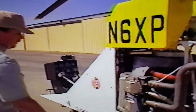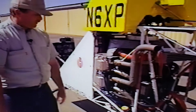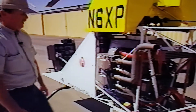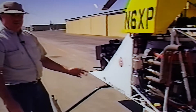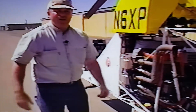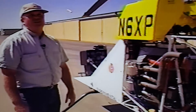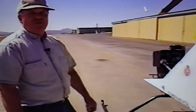As far as the landing gear goes on this helicopter, it's set up much like a Robinson helicopter. It uses a set of tubing that goes underneath the frame and hinges at its attach points — this acts as a shock absorber, but not nearly as well as the Brantley helicopter since there's no hydraulic dampening. You're relying on metal yielding or bending a bit as you land to soften the landing. In a severe hard landing, this would hinge and yield in the center, the skids would fold outward, and that would decrease the speed at which the frame actually hits the ground.